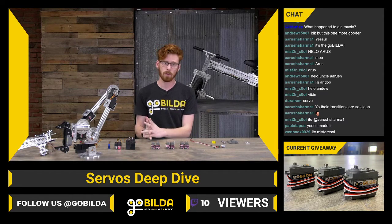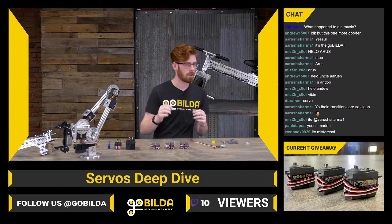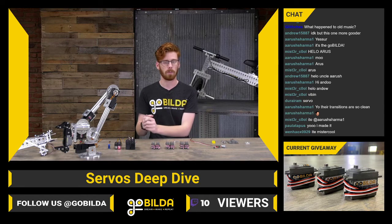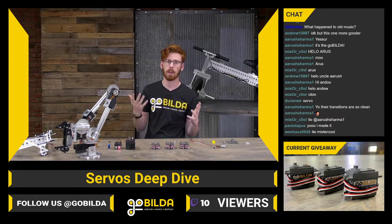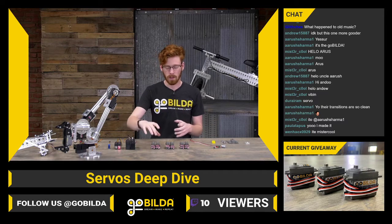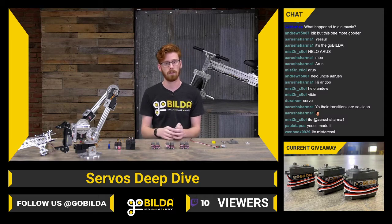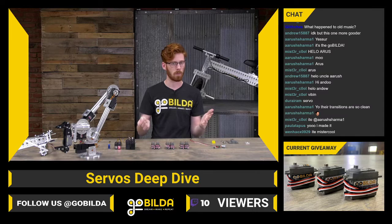These 3 servos will all have the same amount of output power. So that draws on the really necessary distinction between power, speed, and torque. Speed and torque are both independent things, and they can come together to create power. Power is the amount of load or the amount of work done over a specific amount of time. So while this can have 275 RPM and this torque servo can have 50 RPM, they can still put out the same amount of power, or a very similar amount of power.